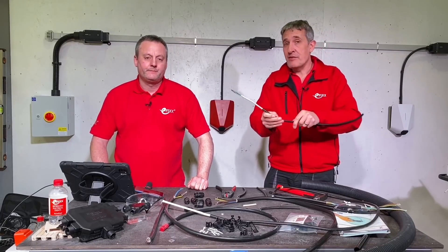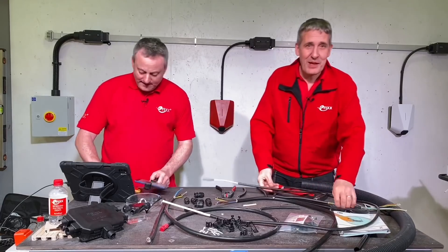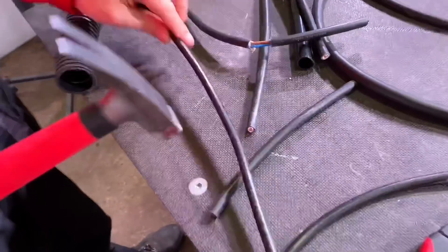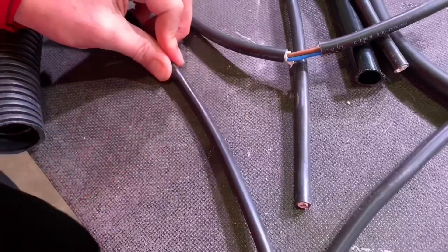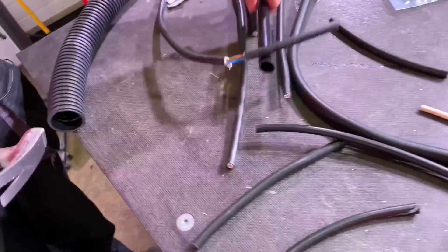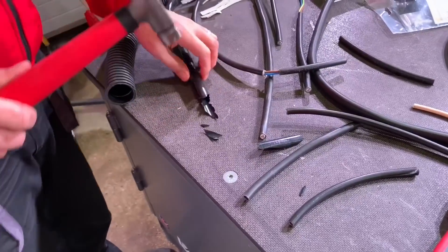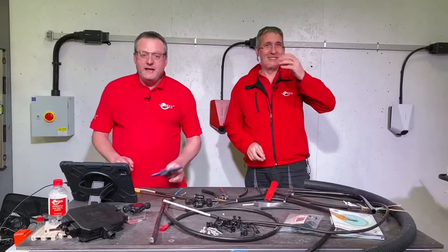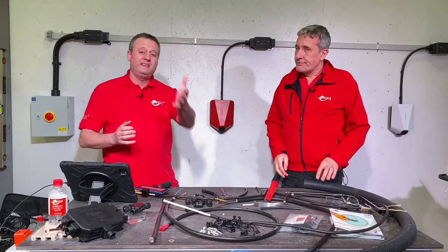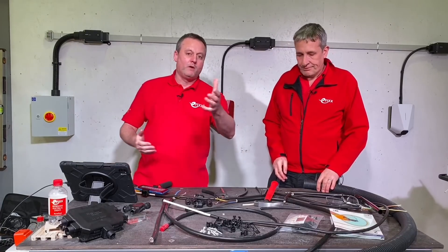This narrow cable is suitable for outdoor use and has a degree of protection against mechanical damage. Let's demonstrate that — glasses on — and give it a little whack with a hammer. Compare that to the alternative, which would probably be plastic conduit. It may not be armored cable, but it's got a good degree of protection and is ideally suited for attachment to the outside of a building, such as for an EV charging point.